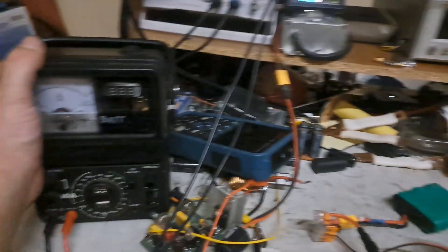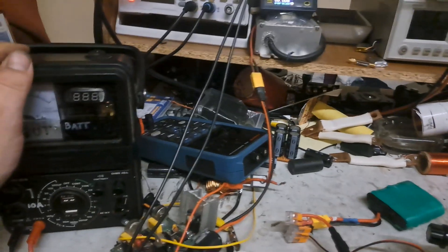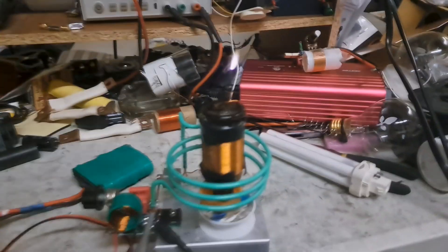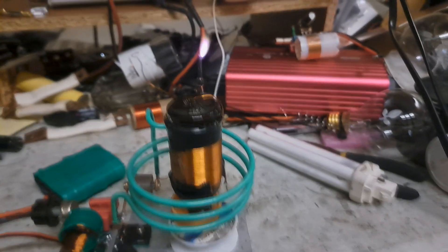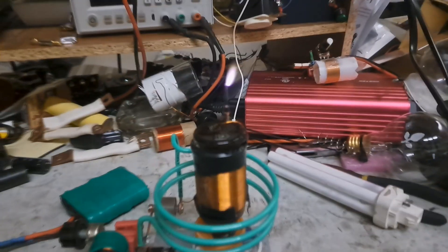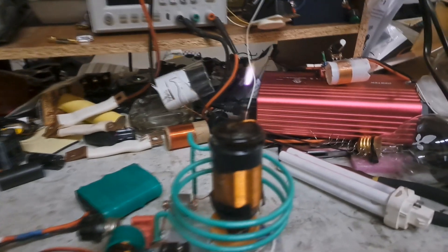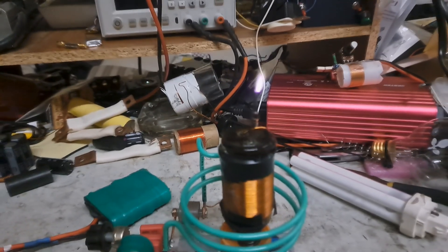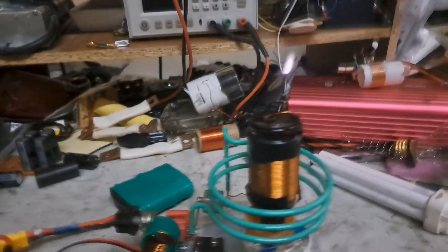You can run them off batteries, but I'd run them off the supply sometimes, typically at least 25 volts or so. The way I've got these tuned, I can't really sustain any kind of flame until I hit at least 24 volts. By the time I get up to 24, this thing will probably pull six or seven amps.